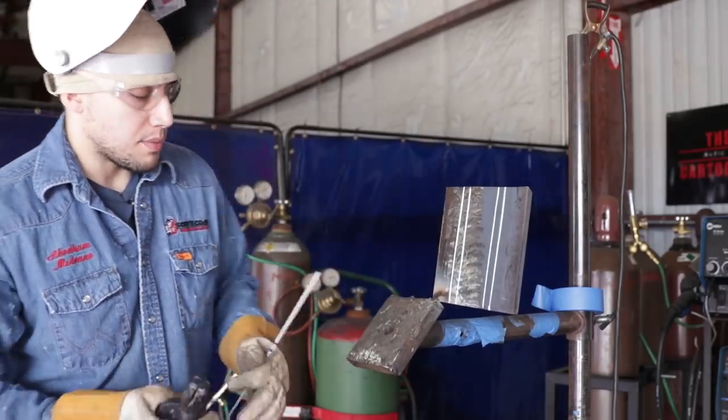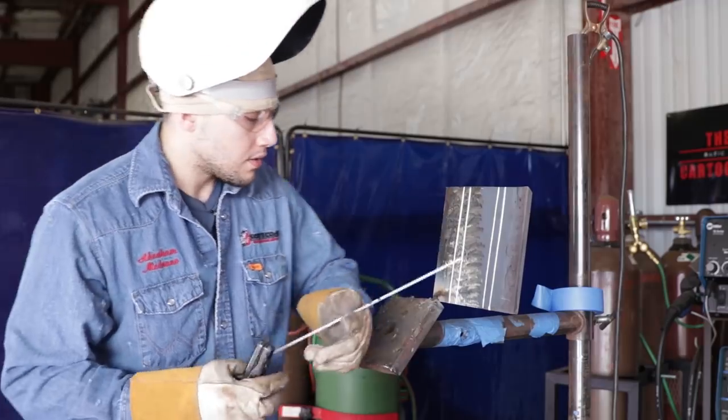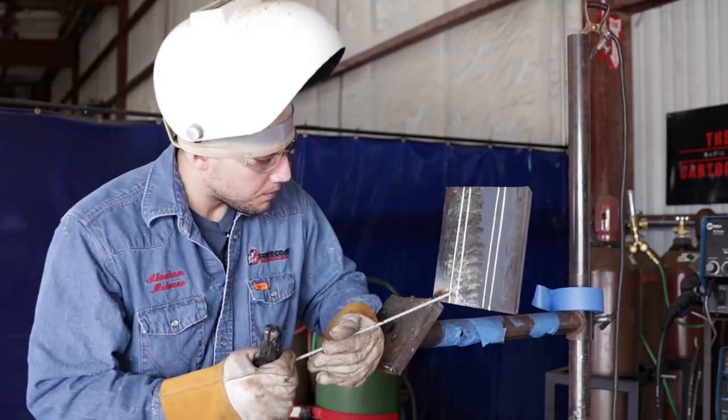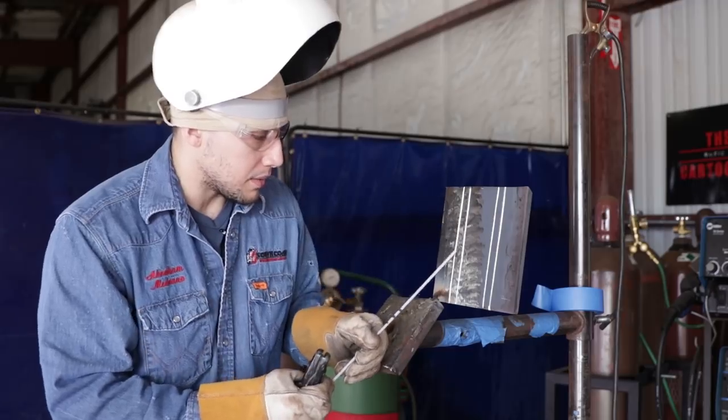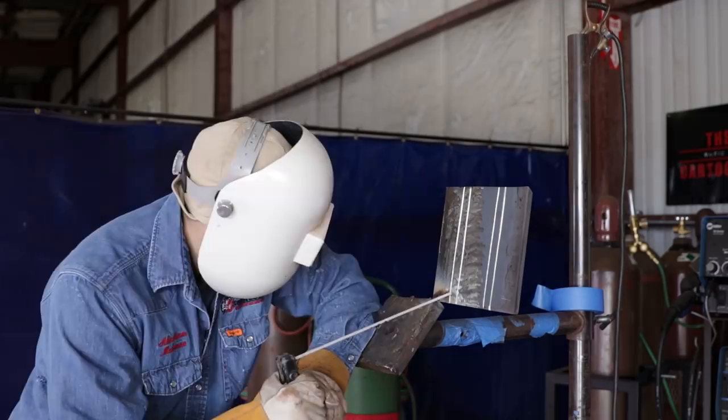All right, guys, so remember, I'm gonna start welding right now. And as I go up, I'm only gonna be paying attention to the left side of the puddle, and I'm gonna be lining it up with this line right here. Strike my rod. Now watch my puddle. One, two, out. One, two, out. One, two, out.